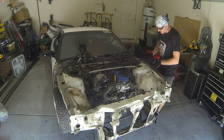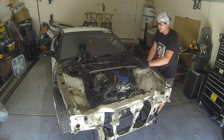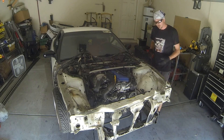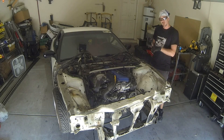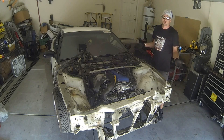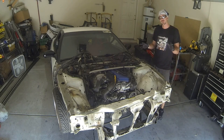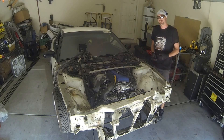It also helps to mark all of this out. If you notice, I've got some bright red markings on here that tell me when and where I want to cut everything and in which order. Use a bright color, mark it out, scribble it — whatever the case is. To recap: take off only small segments, use bright materials, take as much time as you need to trim the fat. The only way you go wrong is cutting the wrong amount or the wrong piece off. Take your time, look it out, scope it out, make sure you plan it inside your head, then get to cutting. Remember the golden rule — you can always take metal away, but you can't necessarily put it back on.